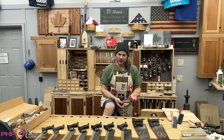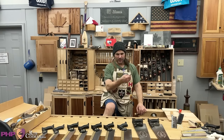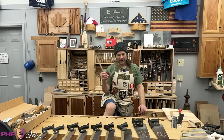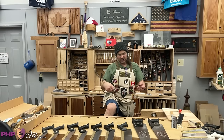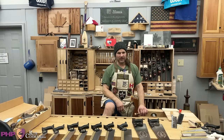But when you go to buy hardwood lumber, you buy random length, random width. So it's not like you're going to go buy a 10-foot by 10-inch piece. It's not how it's sold. Random width, random length. And the grade will determine how narrow those pieces are. The higher the grade, the wider the pieces are going to be. So it's a little bit of a complicated process.